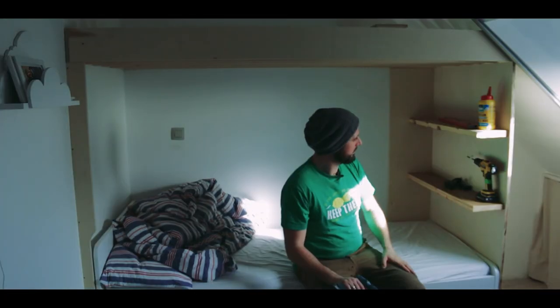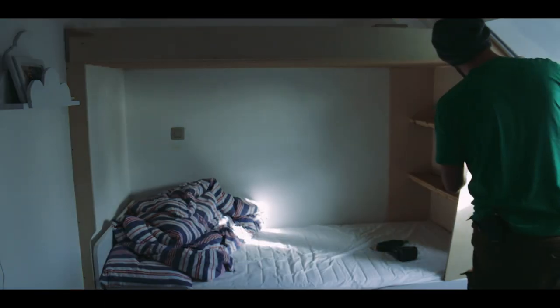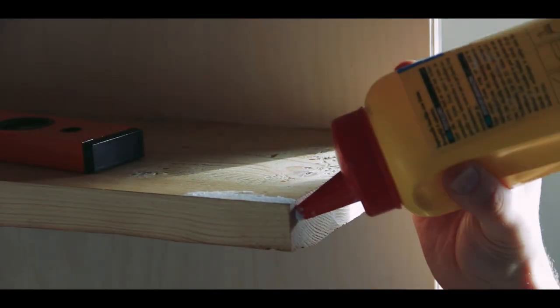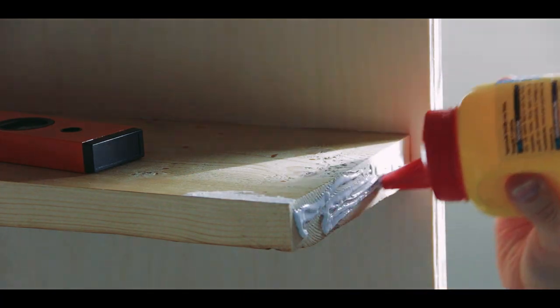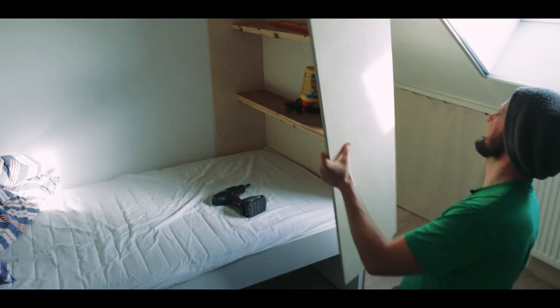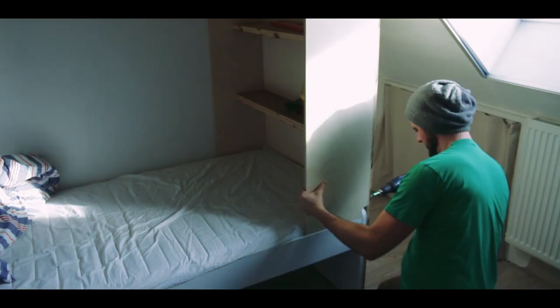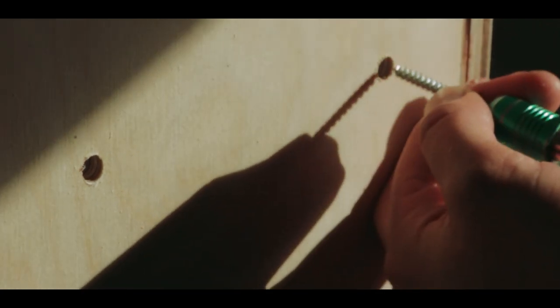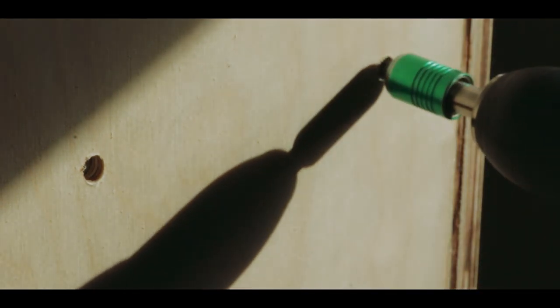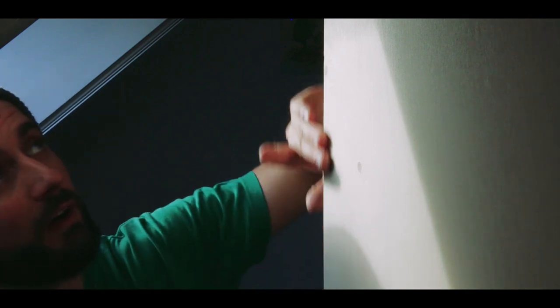The main cabinet is in now. I have to attach a side piece and the one missing plank up here before we can continue to the beautification of the front. On the front side I allowed myself to use some screws here and there because on this end there will be a full face frame when all is said and done with this bed. On the back we have the same solution — dowels and then a blackout side — a pretty invisible way of finishing these joints.